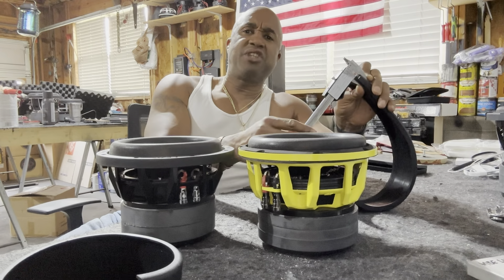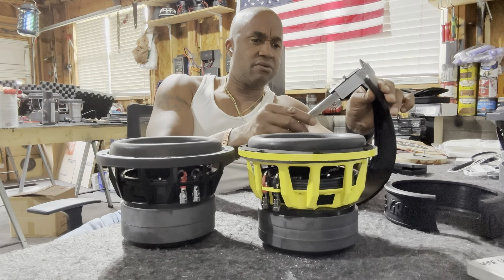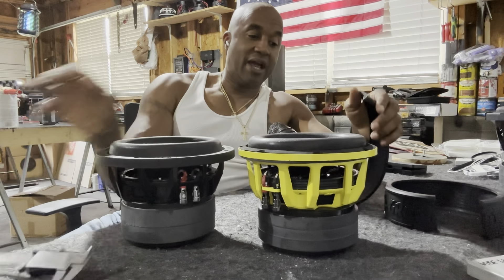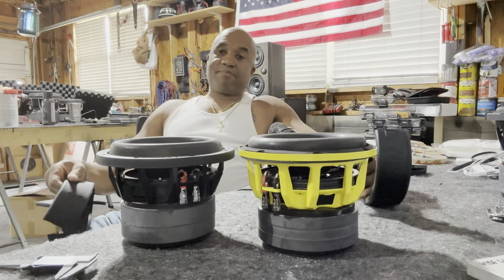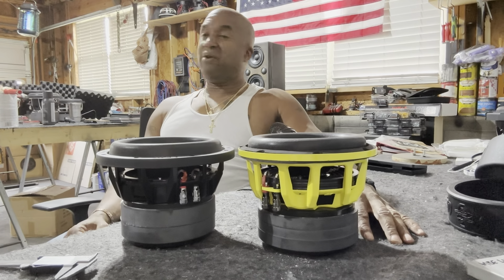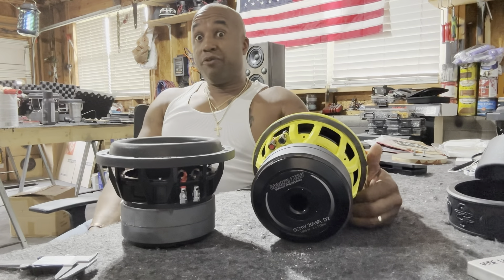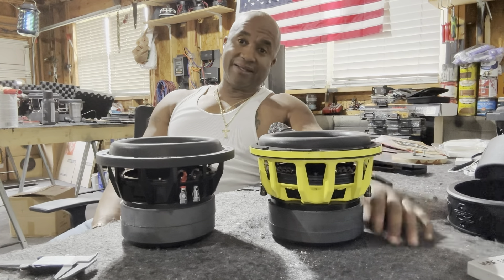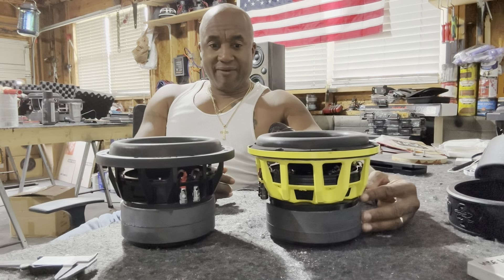It is 4.7 millimeters thick. The ZVX magnetic motor boot is 3 millimeters thick. Now these big edges over here — I don't know if y'all can see that — that's going to account for some of the thickness as well. This magnetic boot is far bigger to hide the fact that you only got three very small magnets. The magnetic structure on this woofer doesn't commensurate with the power handling ability it claims to handle. It also only has one pole vent, no vents around the former, for $250. It also doesn't have a mounting gasket — it has it here, I guess if you're going to inverse mount. I don't understand why they have it there for this price.